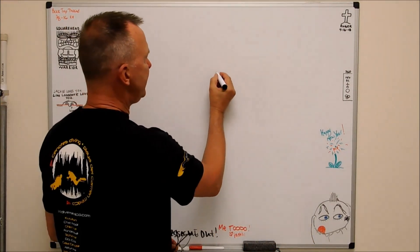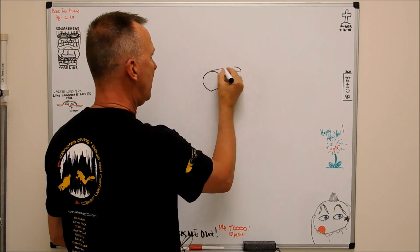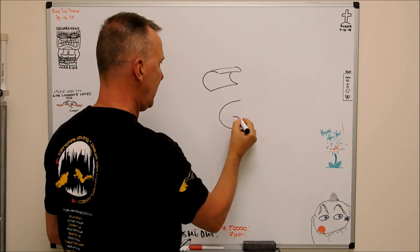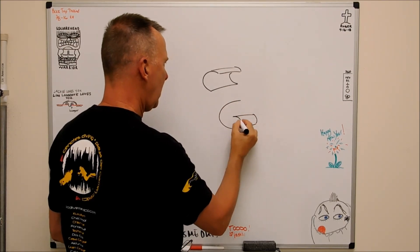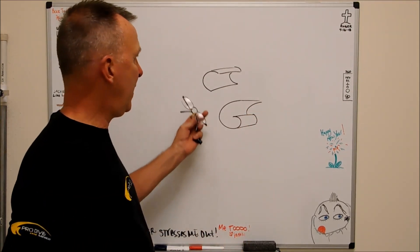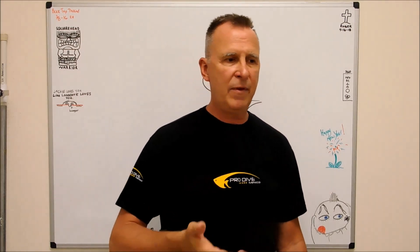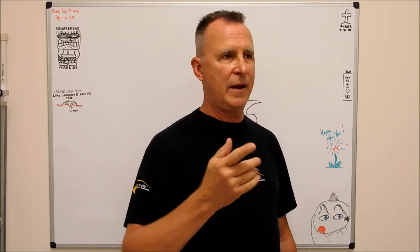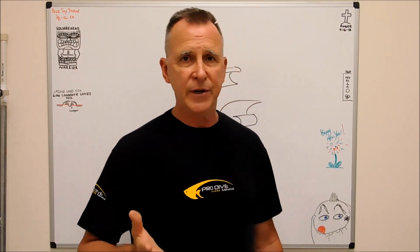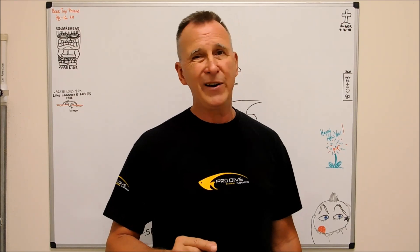The C and 6 chip is just that — a chip that looks like a C or a chip that looks like a 6. You can see why they call it a C or a 6. That comes from the material being thick enough that it doesn't like to bend in a complete circle. It'll go so far and then it'll crack off — it's breaking. Which is why the thing that's breaking it is called a chip breaker.